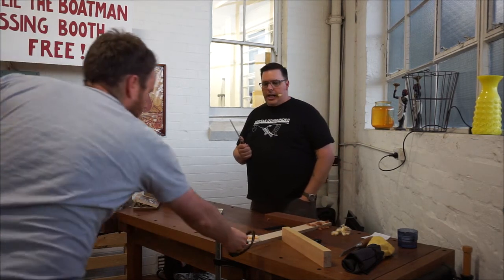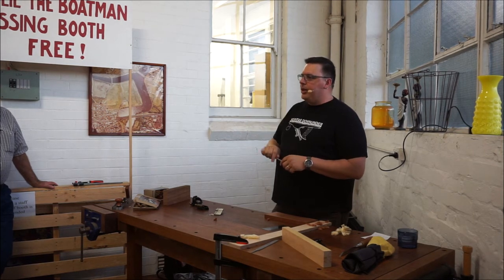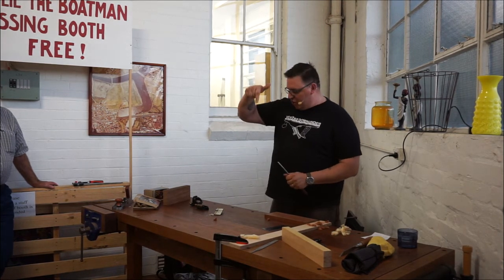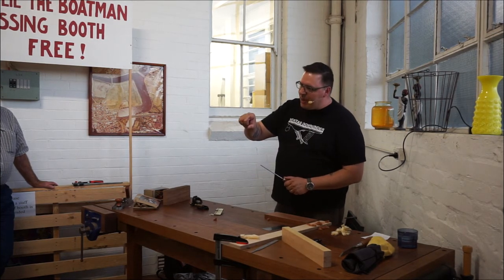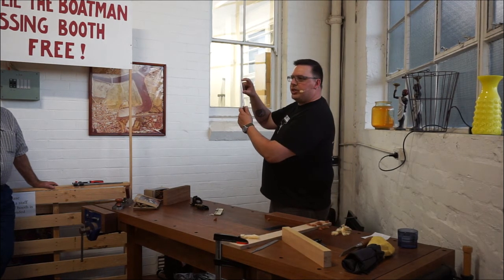Some folks will use an old dead drill bit. If you take a quarter inch drill bit that's not sharp anymore, you take a block of wood and drill that drill bit into the block of wood and leave it there until the flutes are buried. Once the flutes are buried, you end up with about that much sticking up at the top — and that's hardened, high speed steel. The steel for a burnisher only needs to be harder than the card scraper, which isn't very hard to do because card scrapers are pretty soft as far as steels go.